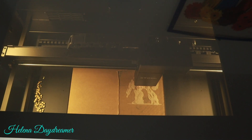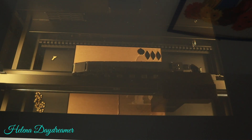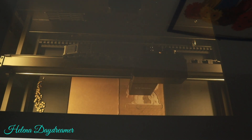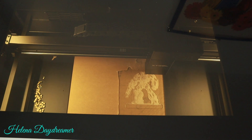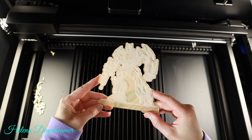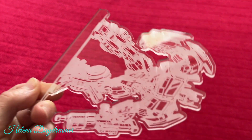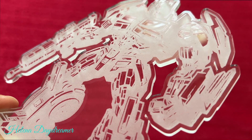So I made this lamp in my previous P2 video — I just wanted to show you how it can cut and engrave clear acrylic. The only thing to mention is the smell. I've noticed that certain acrylics have a stronger smell, for example the iridescent one, and I would definitely recommend using some air filtration unit, ventilating your room well, and also using a special mask when cutting acrylics, or venting outside using an inline fan if you have the chance.